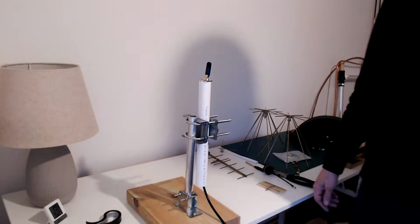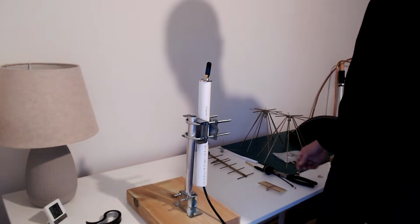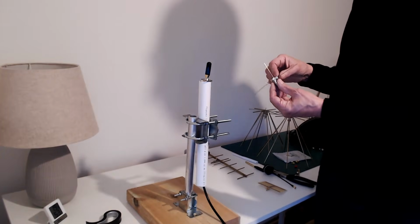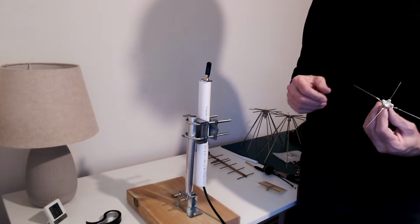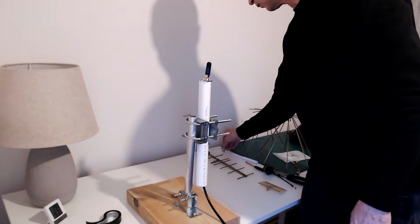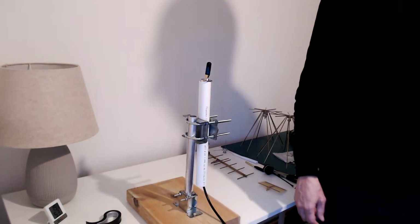It's giving 10 dBs worse performance than the homemade ground plane. At least 10 dBs worse. But it's a broadband antenna, so you can't expect it to be optimized like this tuned antenna is, so maybe 10 dBs worse is acceptable.